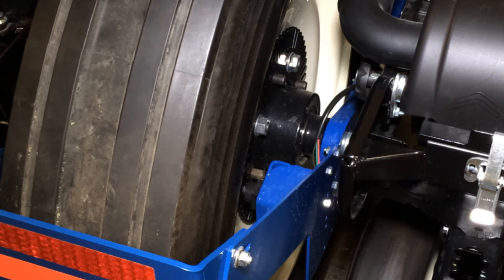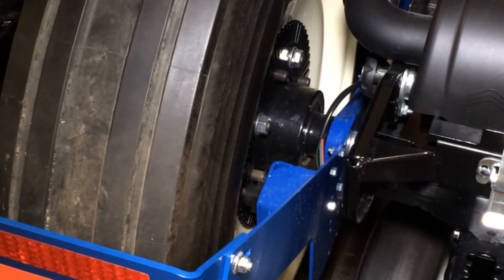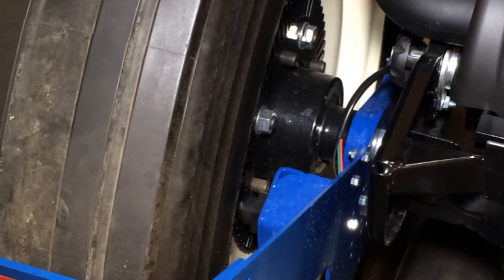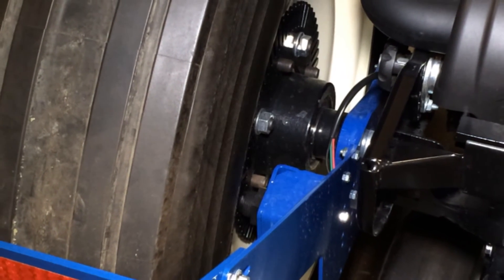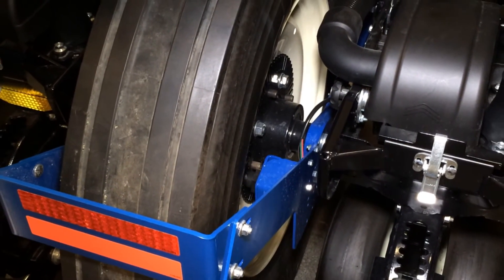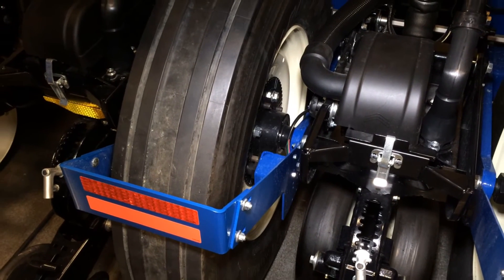The next component is what we call the motion sensor or jump start sensor. It is located on the planter transport wheels, typically the third one from the left on a 3600 or 3660. The jump start sensor is used to get our hydraulic drive turning when we start from a dead stop — such as backing up into a corner and starting a brand new field — and it helps alleviate the lag or delay in our GPS system.